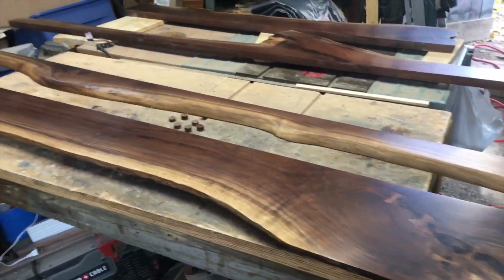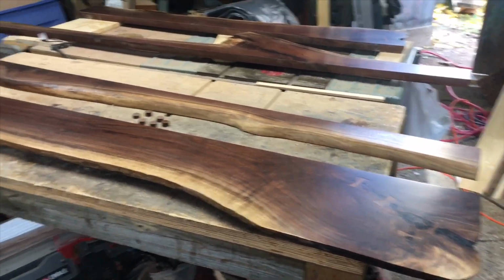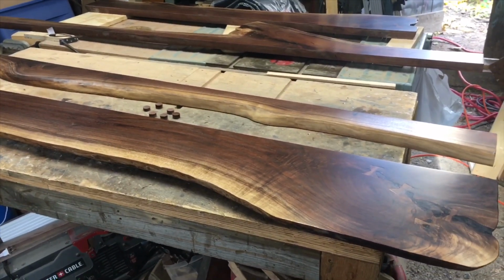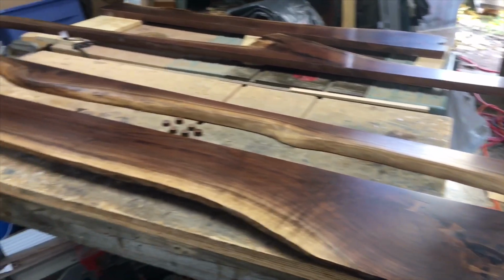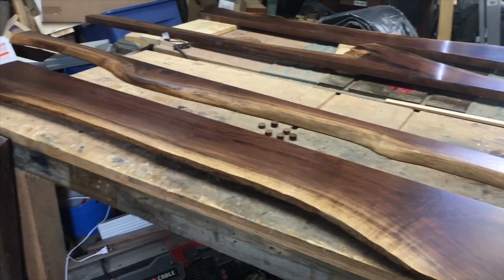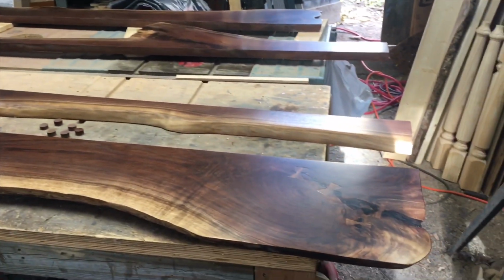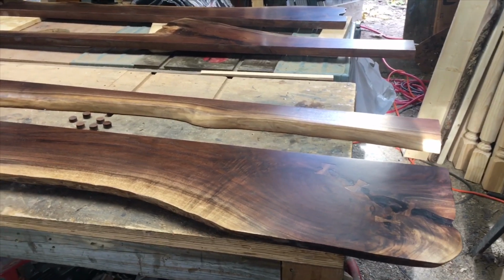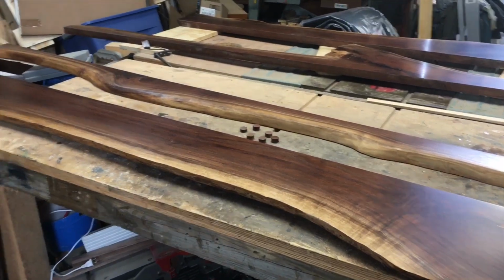Well, I figured I'd give you guys some close-up shots of the mantle build here. I jumped ahead quite a bit on ya. Everything's been sanded. I've done 3 coats of Danish oil using quad aught steel wool. After the steel wool and Danish oil, all 4 pieces sat for about a week to make sure the Danish oil dried fully. Then it was time to apply the wipe on polyurethane. So I applied 3 coats of that.